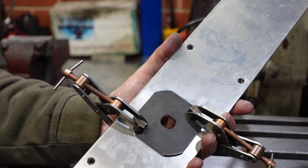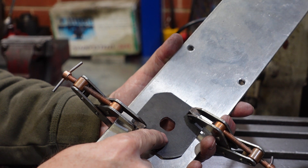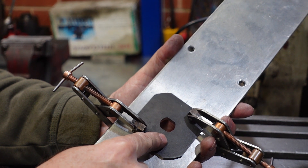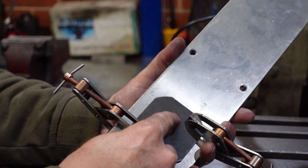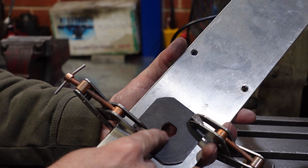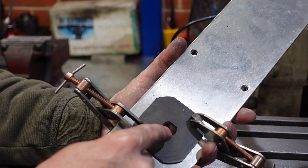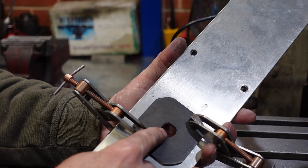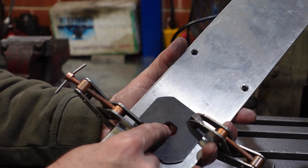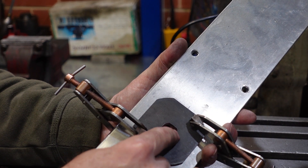So you saw the smoke then flames. The first time I tried that I didn't quite get as hot as I wanted to, so I went back and had another go and tried concentrating the flame around the hole, and that seems to have worked. As I said, it doesn't have to be diamond hard or anything like that - it just has to be hard enough that the file will skate on it a little bit, so you'll feel the difference when you get down to this metal.